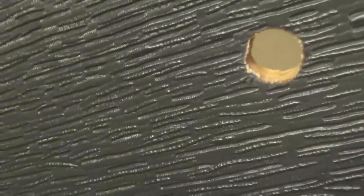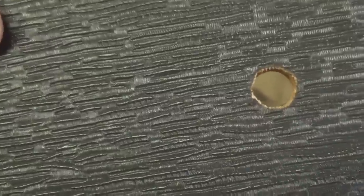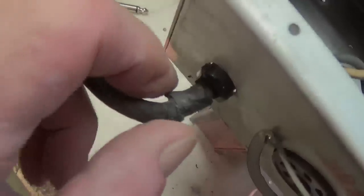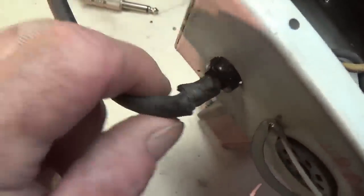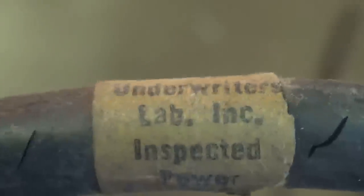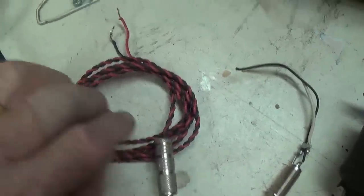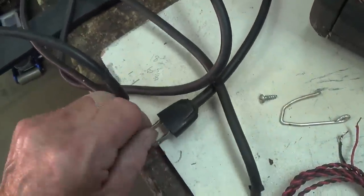Perhaps it was hardwired with a roll of cable in the bottom and a jack that you plugged into a companion piece of equipment, which is long gone. That input jack is not original and was just tacked on to this chassis. And then talk about a frayed power cord — I'm going to wait until the 4th of July to plug this thing in. Actually, I'm going to just cut it off. This is a disaster waiting to happen. But God love them, this wretched cord has the Underwriters Lab inspection seal. Removed the input jack, the speaker jack, a little homemade hook inside, probably to hang the power cord on, and that wretched but Underwriters Lab approved power cord.